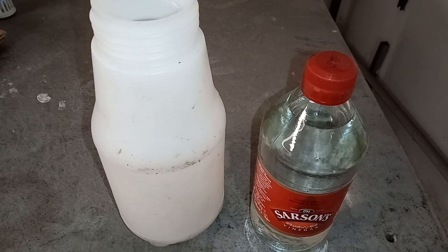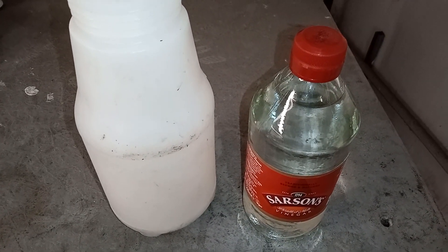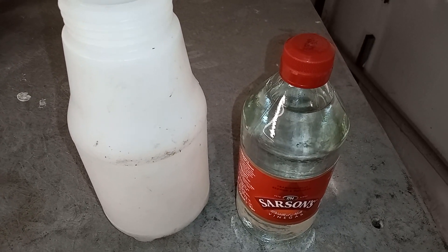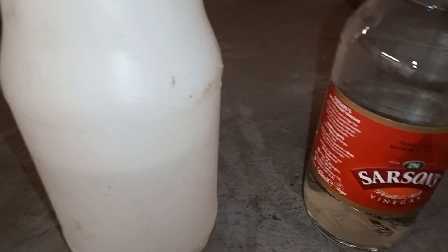Welcome to the Commercial Gas Engineer channel. I'm going to show you in this video the power of distilled white vinegar mixed with water when cleaning out a combustion chamber. I want about 50% water and 50% vinegar. I've made a slight adjustment, bringing the vinegar up to the mark. We've got our 50/50 mix — give it a little mix and I have my spray bottle ready.